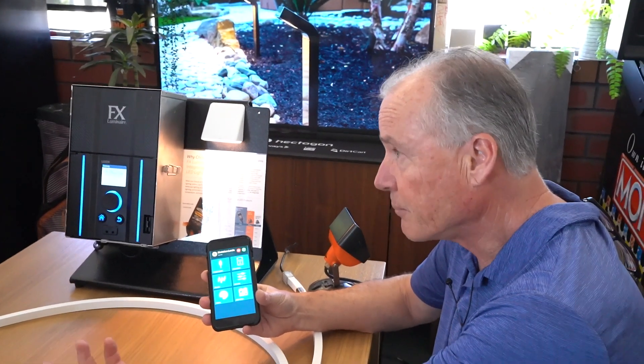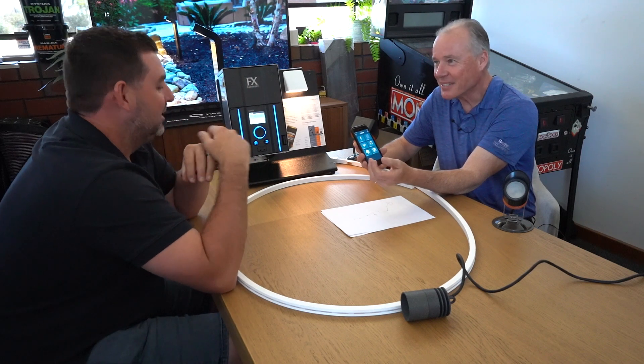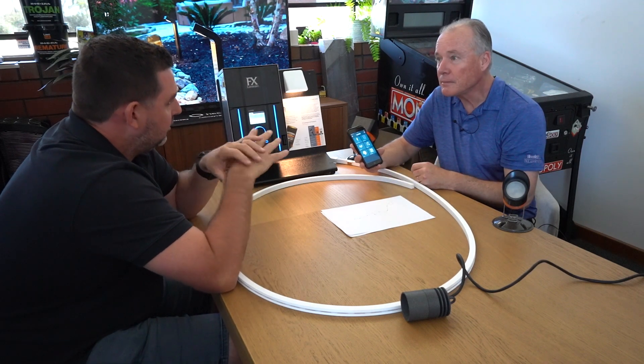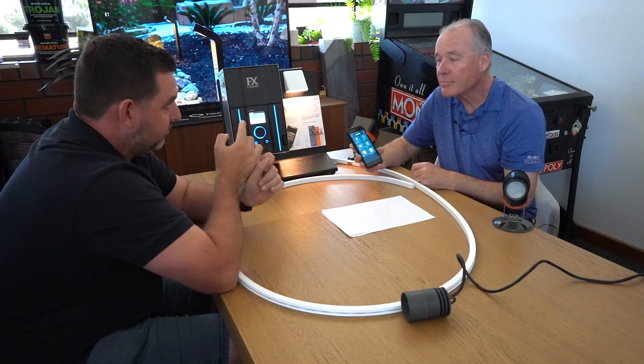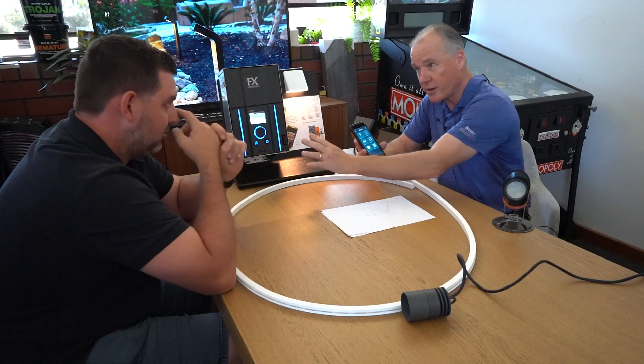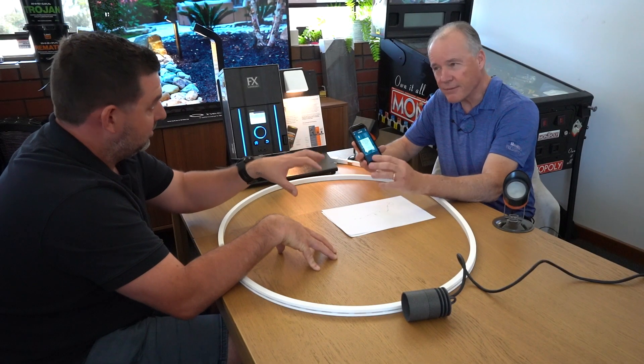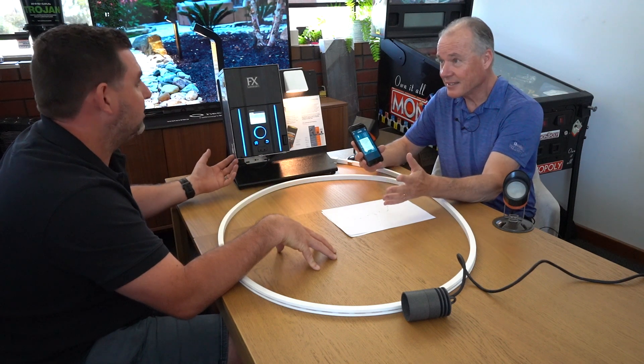How many scenes can you have? At least 26, actually a few more. You can have 250 groups, and how many lights per group? This happens to be a 300-watt controller, so the limit is based on wattage or volt-amps consumed on the system. You're never going to max out your number of lights per controller based on count — it's the wattage that limits you.